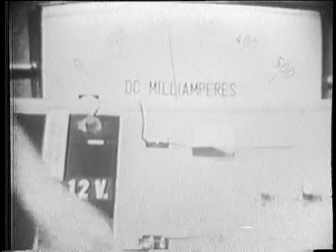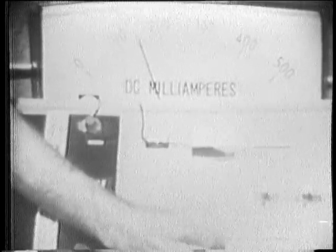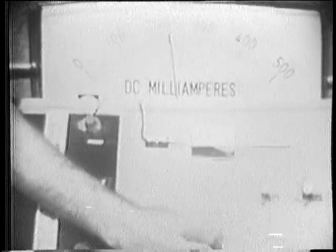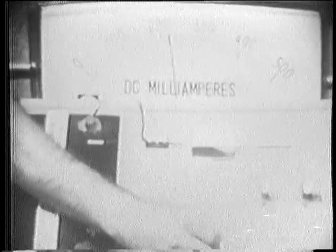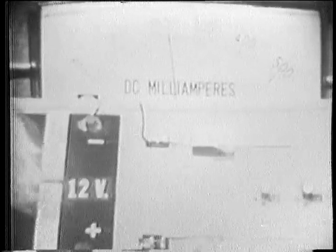If I decrease current by changing this rheostat, less light is produced. The filaments are dissipating less heat, then less power is being used. If I increase current, more work is being produced, so power increases. Less current, less power, more current, more power. Then current and power are directly related in a parallel circuit.